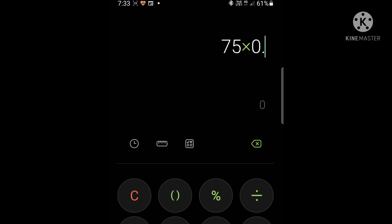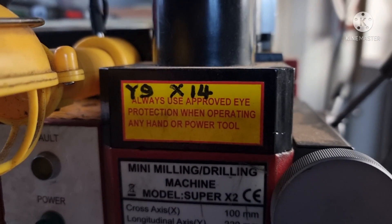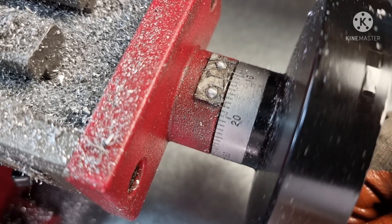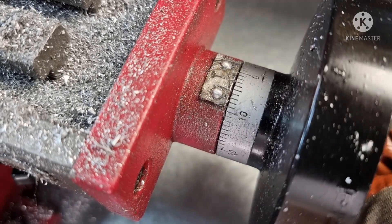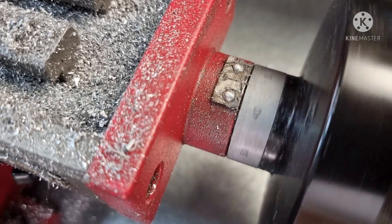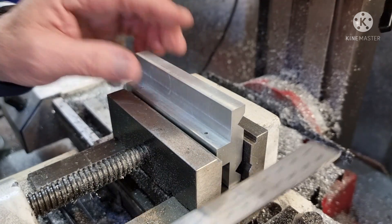So the 0.66 is 49.5 divisions. This is my backlash chart. On the X I've got 14, so I've got to factor that into the calculations — pain in the ass. It's about this time I figured out that this is why people put DROs on their mini mills. This may even be the theme of my next video — stay tuned, viewers.